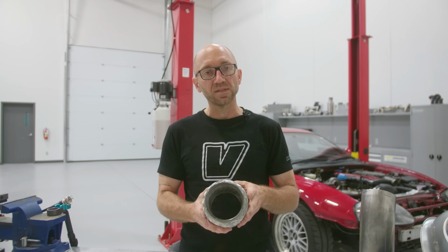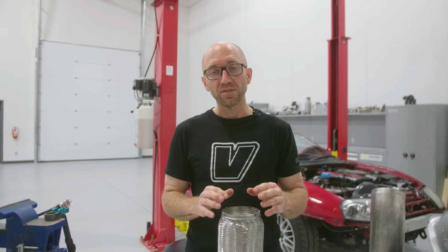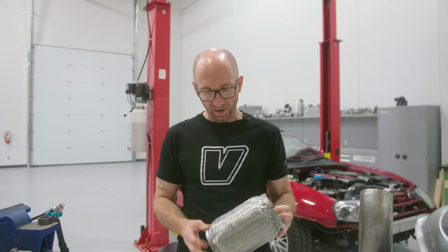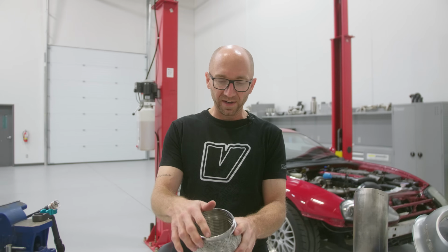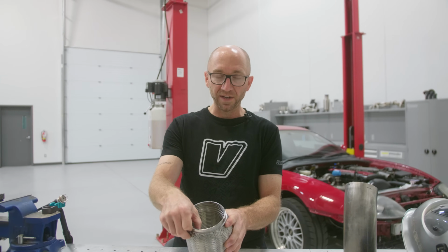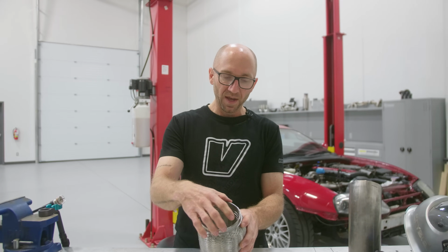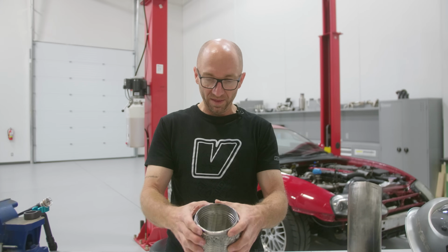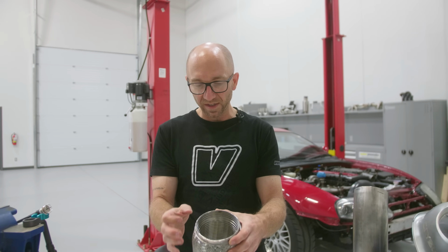I know that it's gonna fit where I have this downpipe all welded together. There's two schools of thought in regards to welding these. Now, some people like to fuse all the layers. There's your interlock liner on the inside, and then you've got that braid wire, and then that outer cap ring. And the bellows ply is also in those layers as well. They're all kind of sandwiched together.